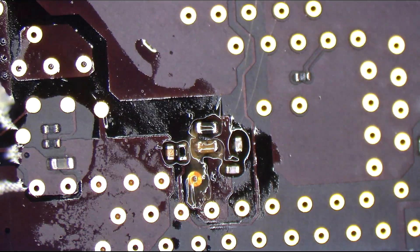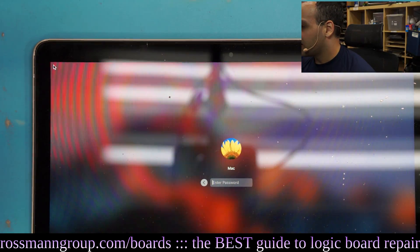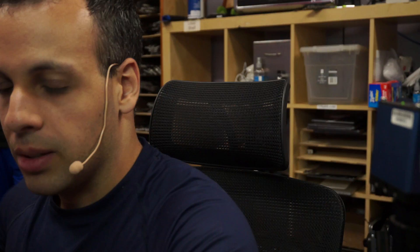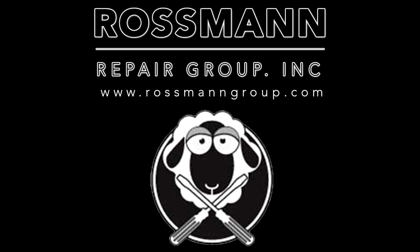Now it's time to see if there's a trackpad here. The trackpad moves — it moves around the screen — which means that we're done. It looks like we had a short to ground in the 5-volt line required for the trackpad to work. After removing the MOSFET, that was the offender. It works again — we have a working trackpad. So that's it for today, and as always, I hope you learned something.